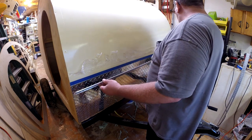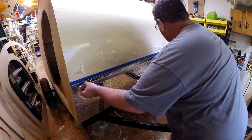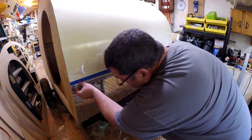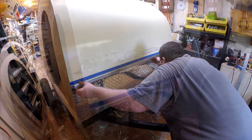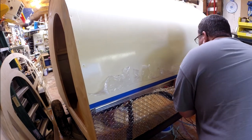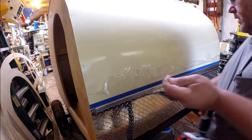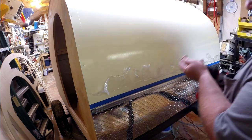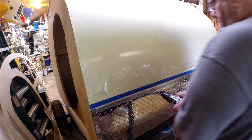You really need to get this positioned where you want it — there's one inch from the edge. I like to go about halfway out and drive one screw before I go to the end, just to help keep the trim from buckling. You don't think it will, but it's not going to hurt.